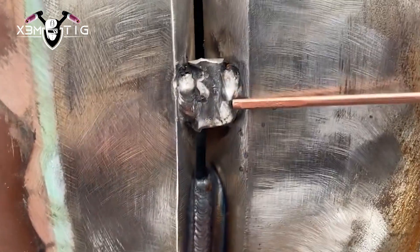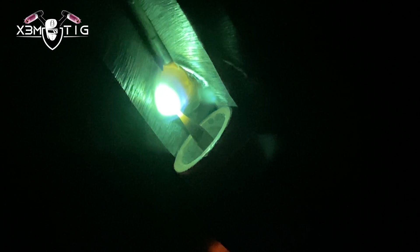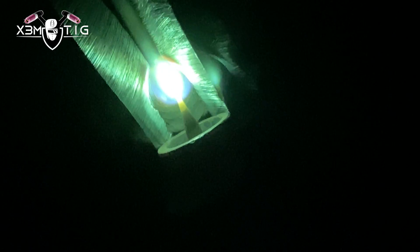You want a heavier root so you're not worried about suck-back later. With nice solid tacks, no worrying about shrinking. On the loose 1/8 side, it's pretty much the same. On the side going from three o'clock up to the top, you want to pull a little bit outside into the bevel with a constant feed — 50/50 inside and in-and-out.